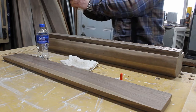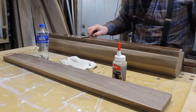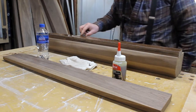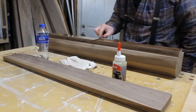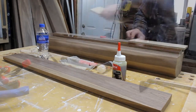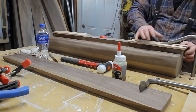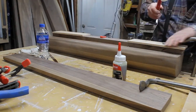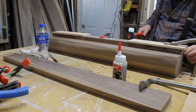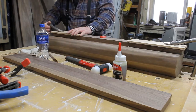Because it's so cold and my garage isn't heated, I use polyurethane glue. I'm not necessarily a big fan of it — I don't particularly dislike it, except for the fact that it foams when it cures, and that's a real pain. With wood glue you can just wipe it clean while it's still wet. Whereas with polyurethane glue, no matter how clean you wipe it, when you come back in 24 hours it still manages to bubble up and foam. Getting back to it — because the garage is not heated, wood glue was just too cold. Polyurethane glue is good down to about 2 degrees Celsius, so that's why I opted for it.